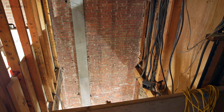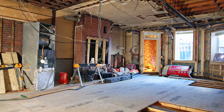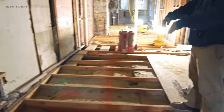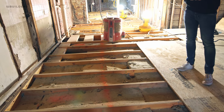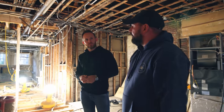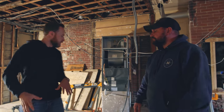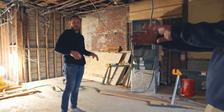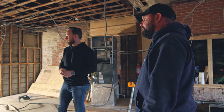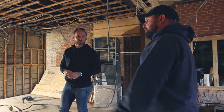Last week you guys were also working downstairs on the subfloor. Walk me through the installation and what the next steps are, including the plumbing and mechanicals underneath. The plumbing is still there — this spray paint line is roughly where we're stopping anything that's going to be glued for this stage, because there's a bathroom here with a shower, vanity, and toilet, plus the staircase on the other side. Basically four or five sheets won't get glued or nailed down so we can still access the plumbing. All the plumbing is to one side and we have steam work to be done in that area, so the area that won't be screwed and glued is all in one spot.